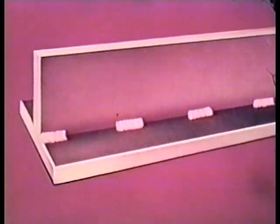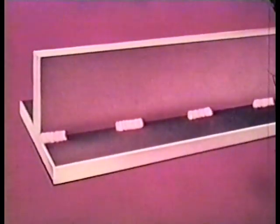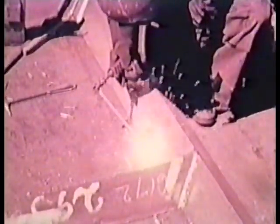Your own experience will uncover other methods. For example, intermittent welds frequently give all the strength required. In this way, you can use two-thirds less weld metal and reduce the effective shrinkage force by that much. On this bulkhead, good engineering design permitted the use of intermittent welds, which meet all strength requirements and at the same time minimize distortion.